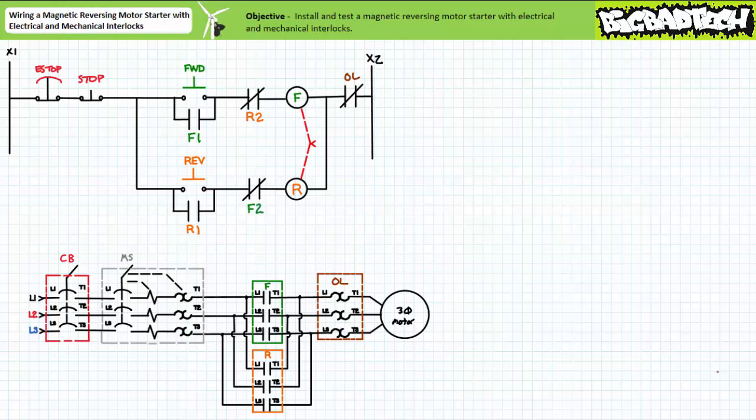These paired contactors are wired such that one contactor induces a motor to turn in one direction, and another induces the motor to turn in the opposite direction by swapping the applied phase sequence. What is vitally important in the safe operation of this system is that these forward and reversing contactors are never to be simultaneously closed. The closure of both contactors is an event where two phases run headlong into each other with no current-controlling element between, which can cause dangerous arc flash and potentially destroy the system or injure or kill nearby personnel.